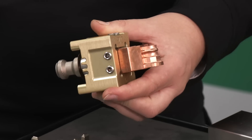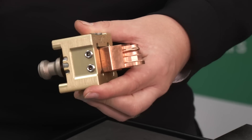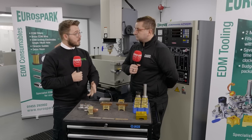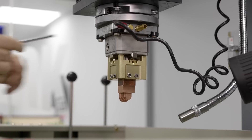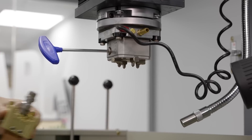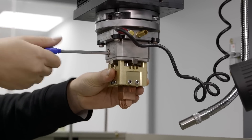With this you've got your pallet system for holding your copper or your graphite to put on your machine. You get a chuck that goes on your mill — there's the same for a lathe if you're going to make electrodes on your lathe. It comes with setting bars so you can get everything clocked up, but in theory once you've clocked it up, that's it — set.